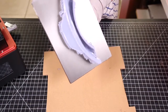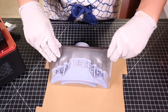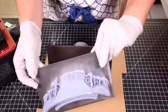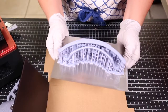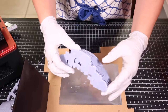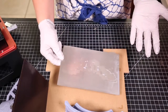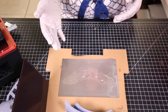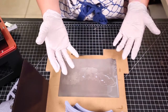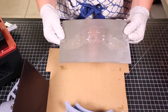I have a finished piece here and we're just going to look for this little tab. Be careful when removing it slowly so you don't splash any resin on your face. I just slide my finger up and remove it just like that. From there, just flex it and it just came off. You probably won't have to do any scraping at all — it's pretty rare, I've never had to do any. The Elegoo specifically comes with metal scrapers; I recommend not using the metal ones and using plastic ones. You don't want to damage this plate. You should be able to just pop it off — I don't recommend using a scraper at all. That's kind of the purpose of having the flex plate.